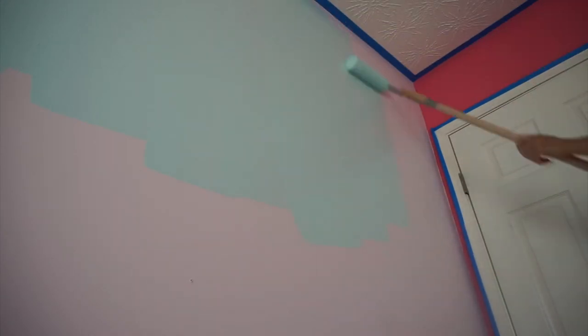You know, when paint is wet, you can't really tell if it's even until it's dry, and then you'll see all the spots that you missed. But until then, don't keep trying to paint over what you've already painted while it's wet, because you're going to mess it up and the paint's going to lift off the wall and you're going to see your previous paint that's on there. So it's not going to work. You just want to go do one even coat all across the wall and everything will look good. I'm telling you guys, so easy. Do not need to hire anybody. You guys can do this. Ladies, women, mommies, you guys can do this.